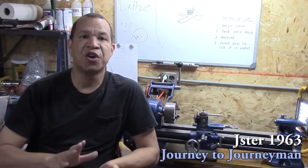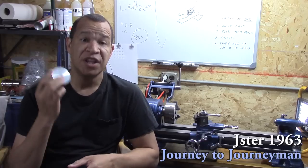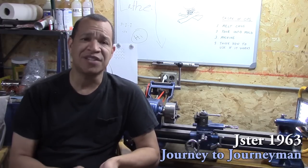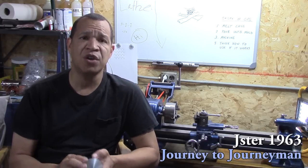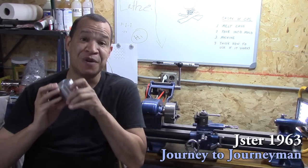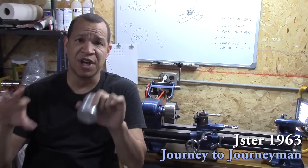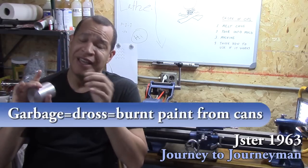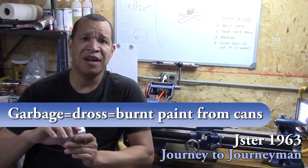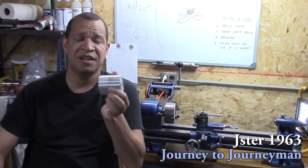Hi guys, just gonna go over some quick lessons learned. Number one, can you make aluminum that's usable out of pop cans from your backyard? Absolutely. Be careful. I mean, it's hot and it's liquid, so it can hurt you. So be careful, but you can take pop cans and turn them into really nice aluminum. I hear a lot of guys say it's a waste of time because there's so much garbage in it, but it's free, guys. Maybe a dollar or two worth of charcoal, and you take your garbage and you throw it away, and you really got some nice, solid aluminum.